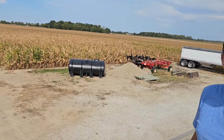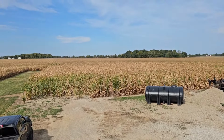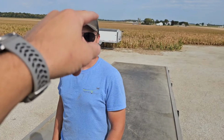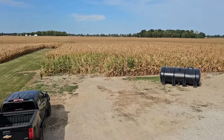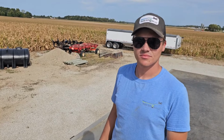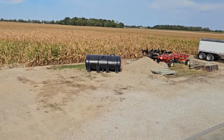What I'm trying to get at here is if you've got 2 of these drones in the air and you've got 2.5 minutes while one's spraying to get the other one landed, filled, and back out, you don't have time to mess with anything else. You are busy all day. And you might get 500 acres or maybe closer to 1,000 with 2 drones. But you're working for it.